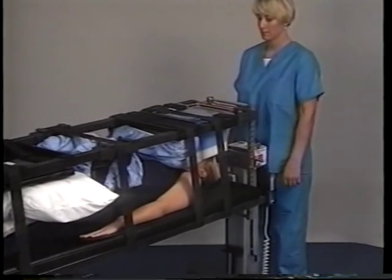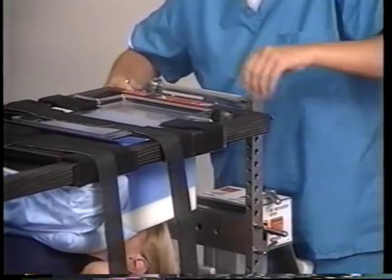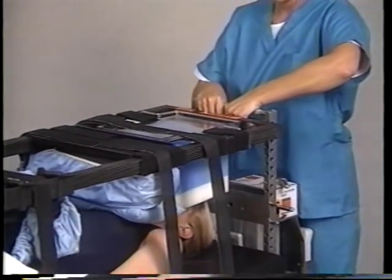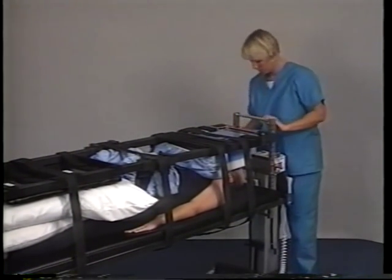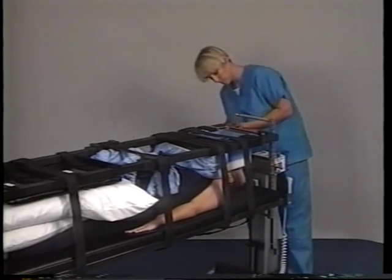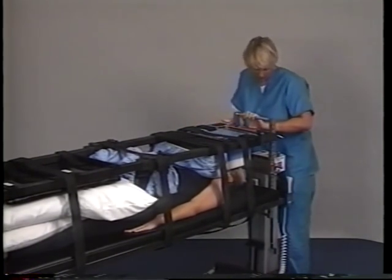The next step is to compress the patient between the tops to ensure that the patient is held securely in place during rotation. Release the Jackson Spinal Surgery tabletop from the head end removable H-frame by removing the upper T-pin, and lower the head end until the weight of the tabletop rests on the patient. Re-secure the Jackson tabletop in the mounting hole nearest to this level at the head end removable H-frame with a T-pin.